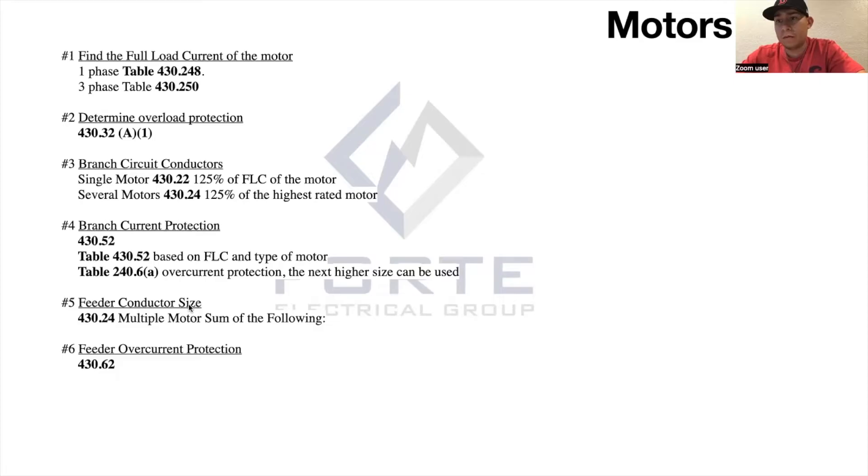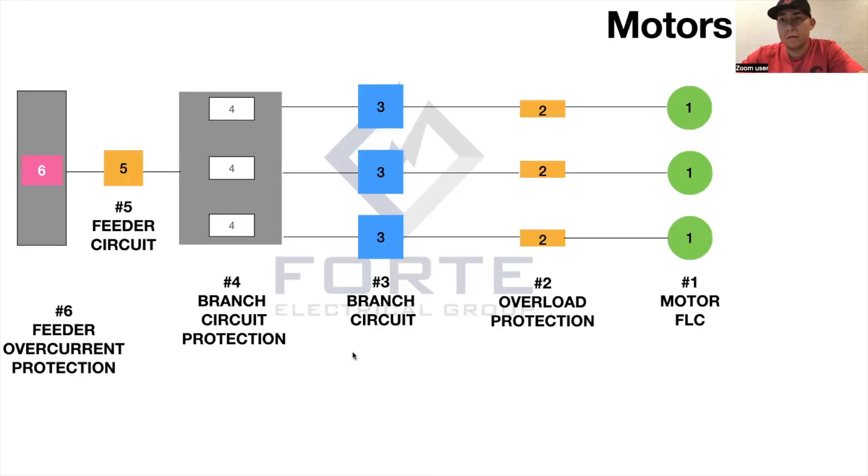Step six is the feeder conductor size. If you're out on location, you've got a transformer bank, a main disconnect, and then it goes into a panel feeding your pump jack. That wire going across location — the size of that wire is determined by this calculation right here. And the size of the fuse in that disconnect is determined right here. Here's your disconnect, your conduit going across location — the one pumpers always get pissed about because you leave a big speed bump or a hole — and then this right here is your panel on your sub-pole right by your pump jack.